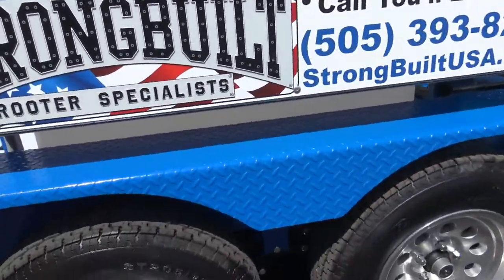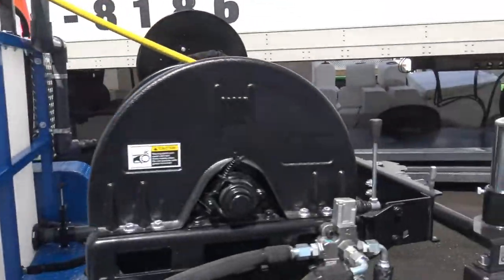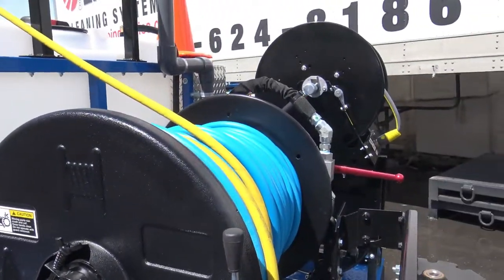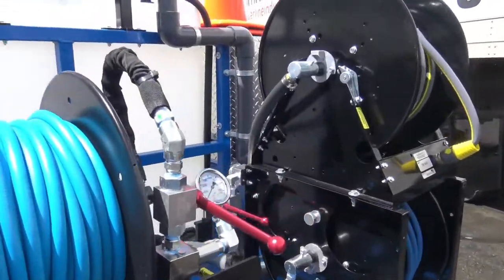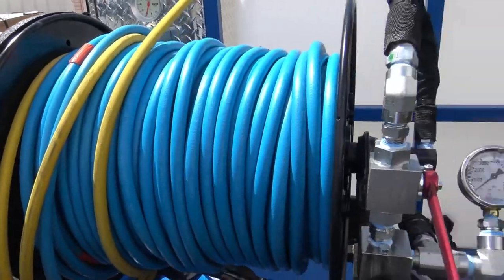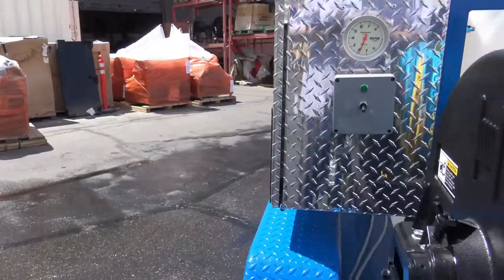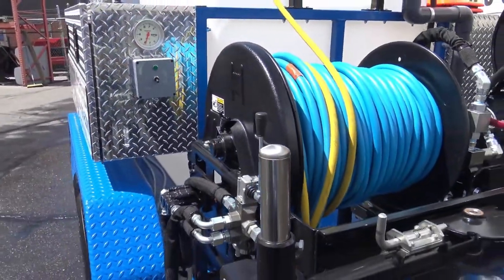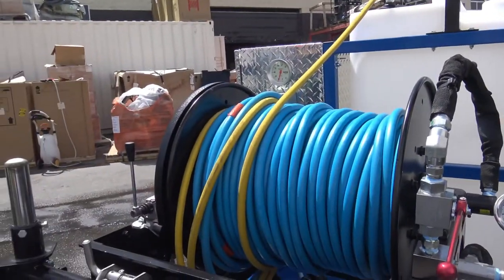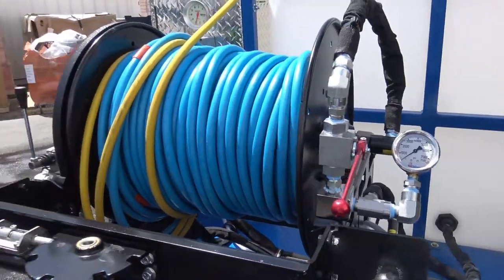This is hydraulically driven back here on the hose reel — this is what separates the man from the boy. It's hydraulic drive. If you're looking at a unit under $50,000, rarely will it have hydraulic. Hydraulics are superior in power — you can power out, power in, and variable the power. We like electric hose reels, we've done a ton of them and they're good, but this is great.